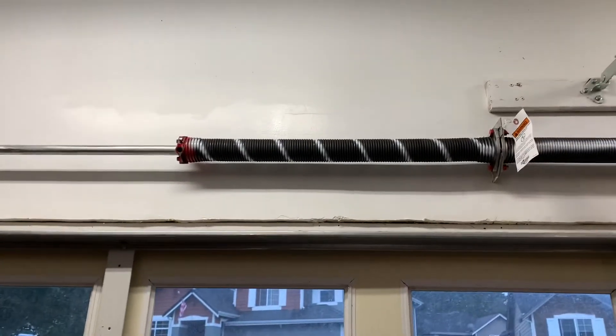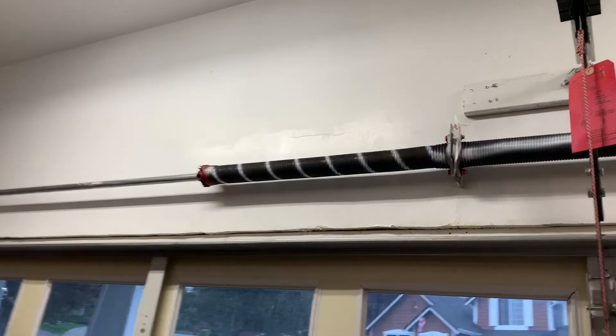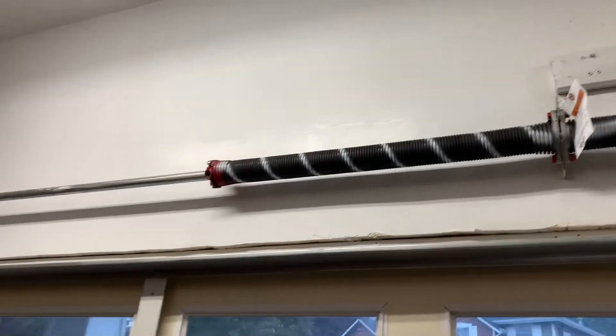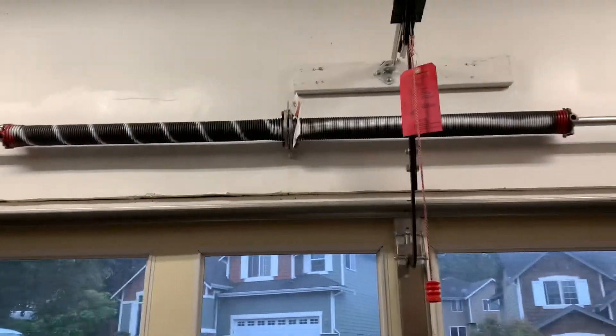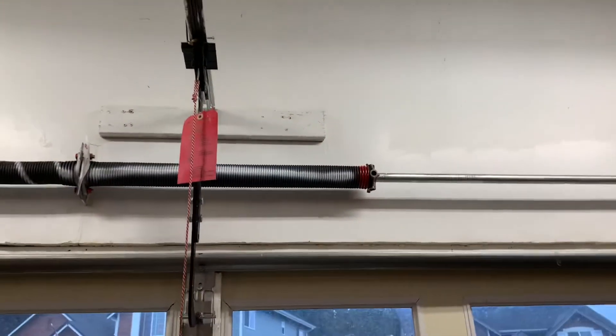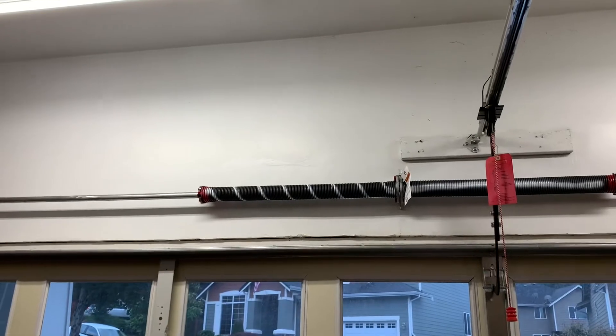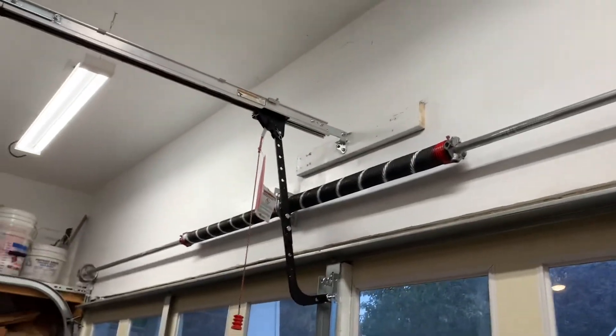Everything is installed with quality bearings on both ends. We've cranked and turned the left-hand side spring. The right-hand side spring we haven't done yet — you see the white line where we sprayed it with white paint. There should be roughly seven coils: one, two, three, four, five, six, seven — seven coils. Each coil is roughly three-quarters of a foot, so for a seven-foot door it should open fully. You have to shove the rods into those holes and crank 30 quarter turns to get those seven coils. The other side is now cranked to seven turns and locked in place.